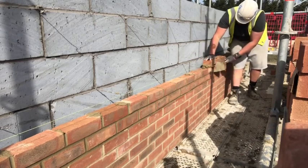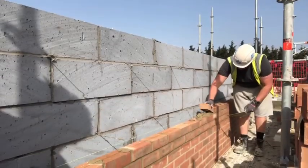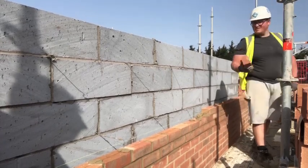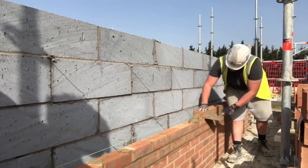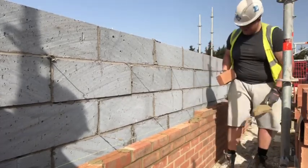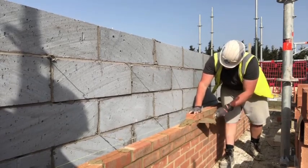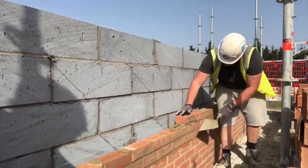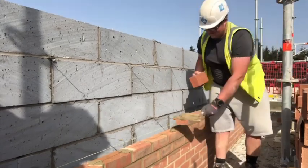If you could see at the beginning of the video, I put a picture of my profile setup with the gable profiles — I think I mentioned these before. Very helpful. They take slightly longer to set up, but overall the right way to do it. They actually mimic the time of using a pointing trowel behind the profile — you think you're going quicker with a pointing trowel but you're levelling it multiple times. With these profile stabilizers for aluminiums you get a more stable profile.